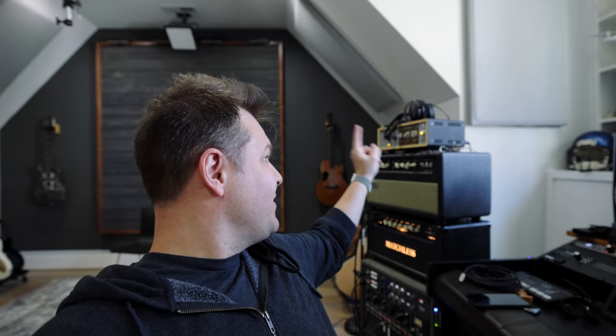Let's try it and see how it sounds. We haven't talked much about the Universal Audio Ox, which is right there on the channel, but we have some content with it coming soon. So you run an amplifier into it — you can run 4, 8, or 16 ohm output into the Ox. It receives the load from the amp that a speaker cabinet would, so you can then direct out of the Ox. It has a left and right quarter-inch out, because you can't just take a line out of an amp without loading it — if you just take the output of the head and run it into something, you'll blow stuff up.